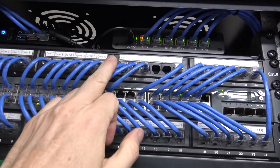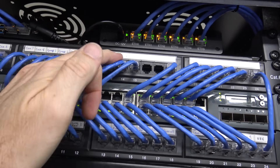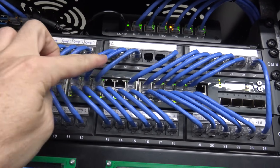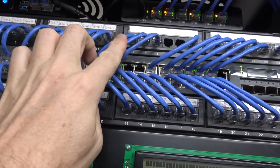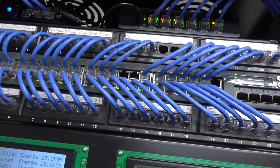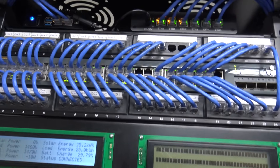The other end of those outlets goes to the patch panel here. These two here go to that room — those two RJ45 sockets. I've also got this little patch cable here that I made, so that could be dodgy, or the cabling from there to there could be dodgy, or the back of those sockets. So I'm going to find out.